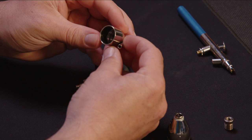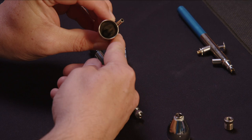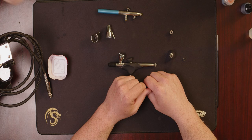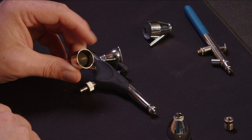This one here will work for most of your siphon feed brushes. This particular one is a Badger model. The bottom part of that stem is actually all the way at the bottom of the cup, so when it draws the paint up, it's drawing the paint from the bottom up into the brush — it's just a much better design. The tube for the Master cup stops when it hits the body, it's just open. But the Badger one, the tube goes all the way to the bottom — it's like a straw siphoning from the bottom.